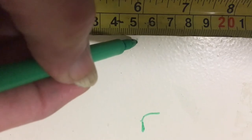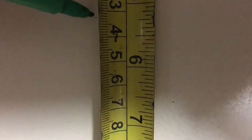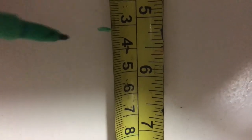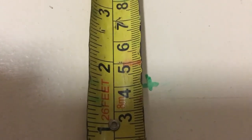Before I paint my doors I'm going to be drilling the holes where the attachments that go on top of the door are going to be placed. Measuring from this side, we're going to come in 150mm. From the top of the door you're going to go down 4cm, and then we're going to go down to 13cm, because you need a gap of 4cm and then 9cm — so that makes 13cm. We're going to be drilling on that mark on both doors, with the same measurements on the other side of each door.